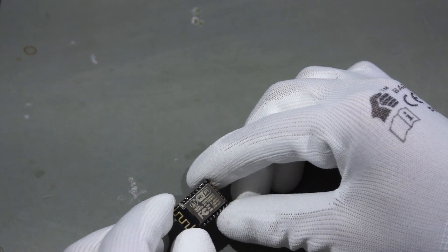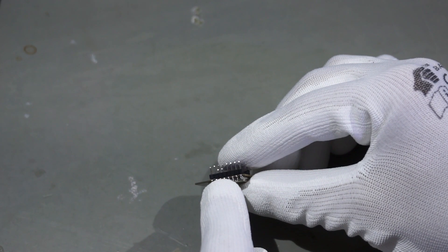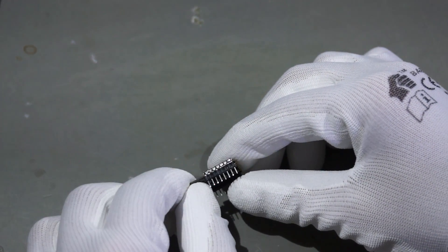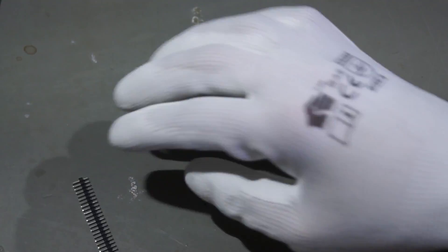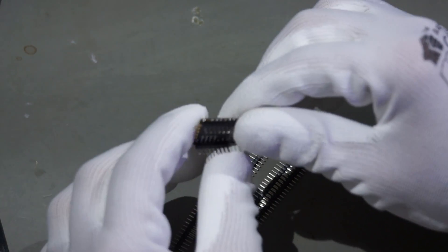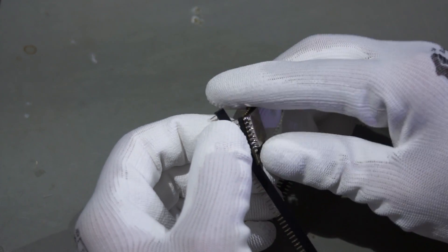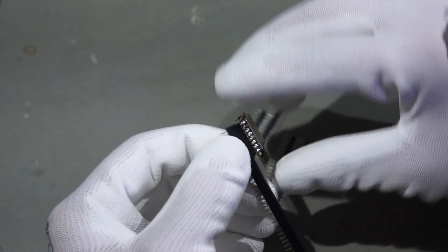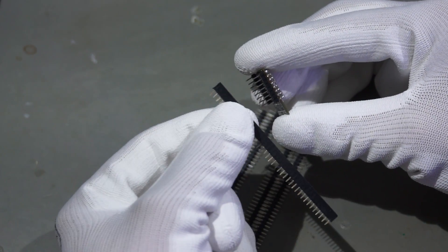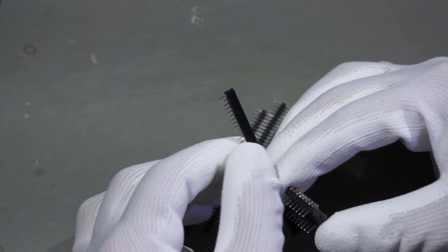I love playing with the ESP8266, but it has one disadvantage: the pin distance is only 2mm, so it does not fit normal breadboards and we cannot use standard pin headers. This is why I purchased a few pin headers with 2mm distance — both male and female. Now I can build a nice module and use it like Arduino shields. You just need male and female pin headers with 2mm pitch, plus of course a custom PCB, which is not a big problem these days.